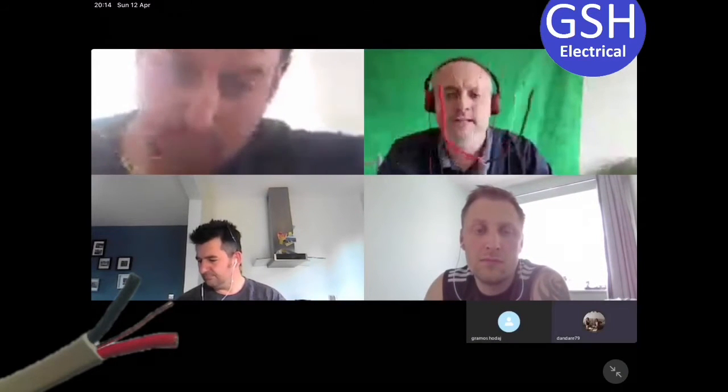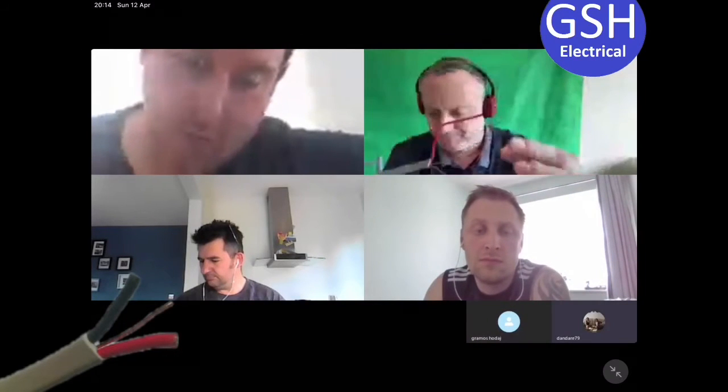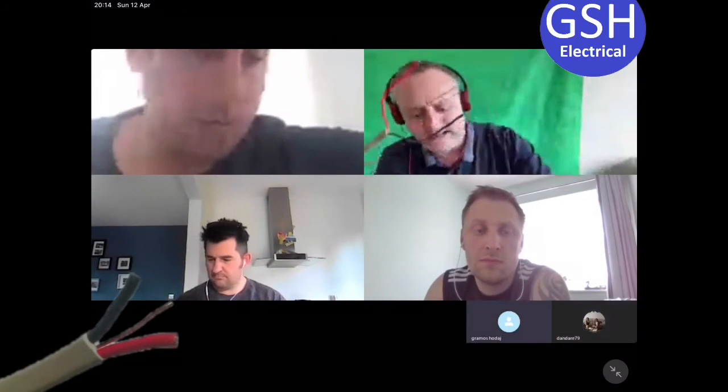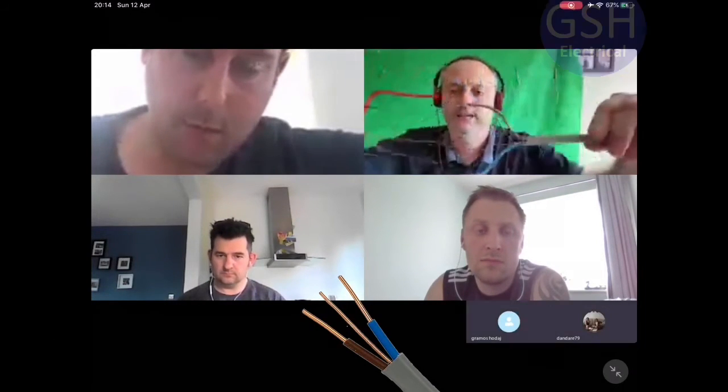Now, we can see this very regularly in domestic dwellings. And as you move towards your domestic installer course, you're going to see these types of things. However, there is nothing stopping us from interfacing the two conductors. So our new colours, we're really comfortable with from the workshop, being brown and blue. And we're really happy with the fact that we can interface those conductors. In other words, in the back of a socket outlet that's already got red and black in it, introduce a cable which is brown and blue. Same with the lighting circuit, etc.